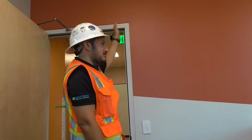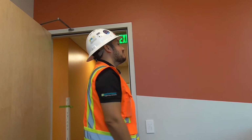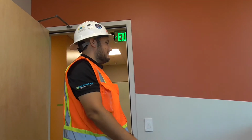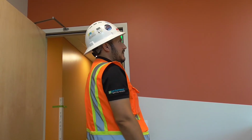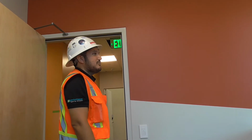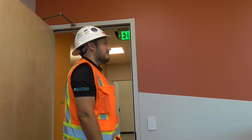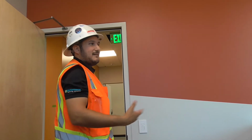Now, if from here to here is good, but from here that way, when I hit the switch, it might only be turning on or off whatever this power pack is controlling. But again, without looking at the plans and seeing everything, it's hard to tell you how they ran the Cat 5, because it can start from here or off to the side. It just depends on how things were run. Environmentally, I saw a T-bar, but they might have fire-rated walls in some of these rooms that go up, and they have to put a conduit through it, and the conduit's off to the side. So every room might be a little bit different. These offices, they might be right above the door right here. Typically that's where I see them, but again, I can't speak for them.